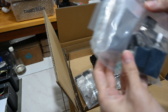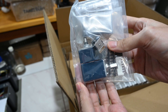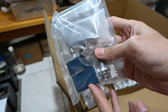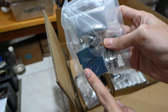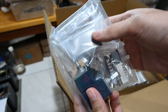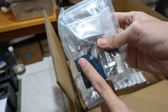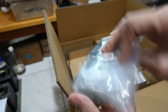And finally we can see the big volume pot, should be from Alps. Interestingly, the Elekit TU8550 is using a four-gang volume control. The idea is to use two for volume and two for gain. On my previous preamp, the TU8500, the gain was switchable with one switch. But on this one, they make it variable, which is quite interesting. One is for balance and the other is for the input selector.